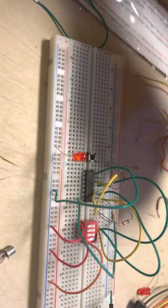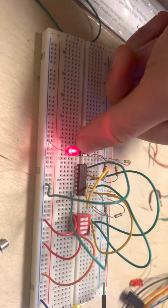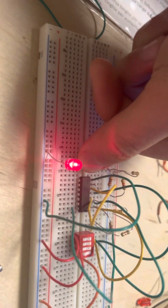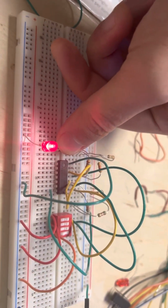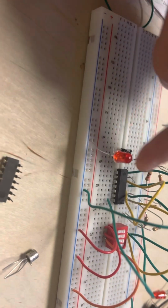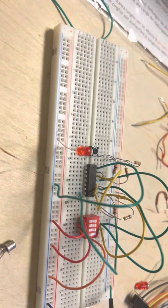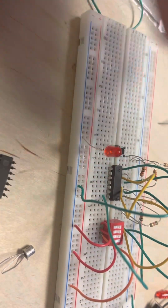And it's working. Of course, this allows more current to go through, which I think is dangerous for the LED, but I think it's just enough. The LED isn't too bright or anything. Originally it was just the 200 and the LED was really bright, so that wasn't good. So then I added the other resistor and it works. Those are the three pull-up resistors.